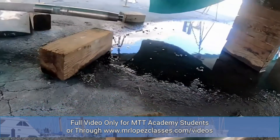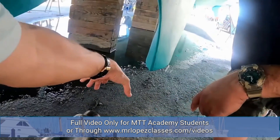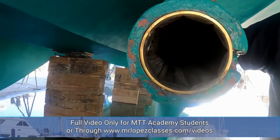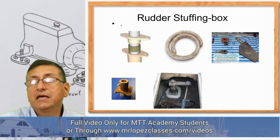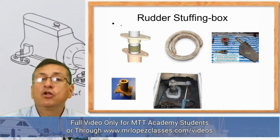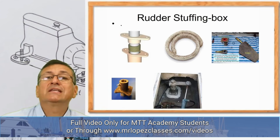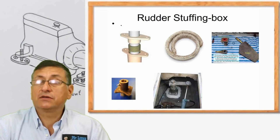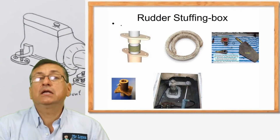And this is the shaft. Look at the shaft — it goes all the way in there. And the coupling, the transmission is over there. The coupling is located here. What happened with the rudder? In the shaft of the rudder, the rudder uses the same stuffing box — exactly the same stuffing box used in the propulsion system on the shaft. Normally, the stuffing box located on the shaft of the rudder is the mechanical stuffing box with the seal packets. This is another element where it's possible that water penetrates and enters the boat.